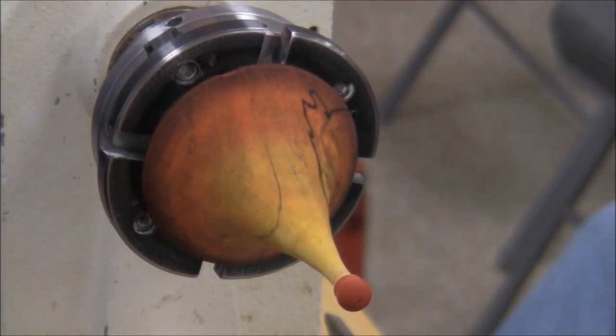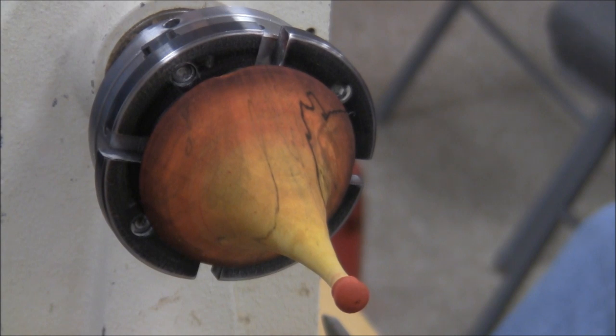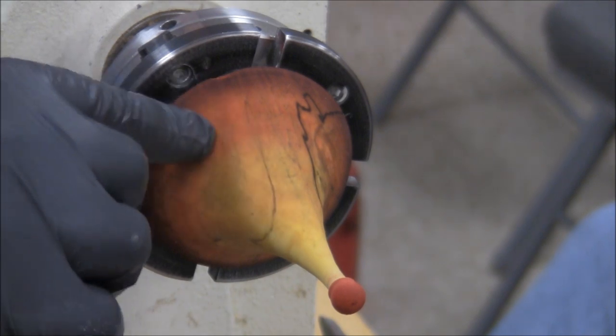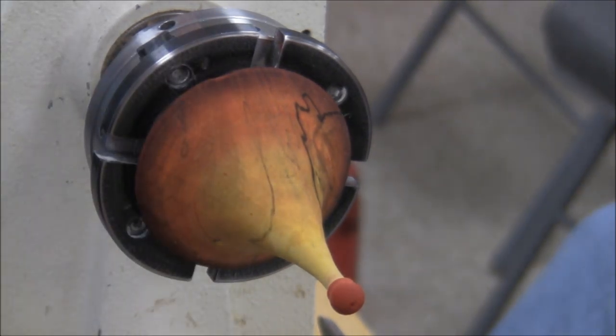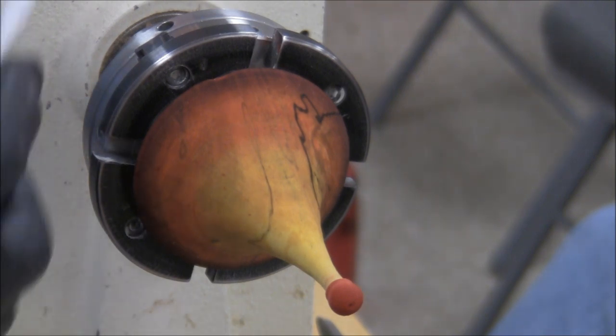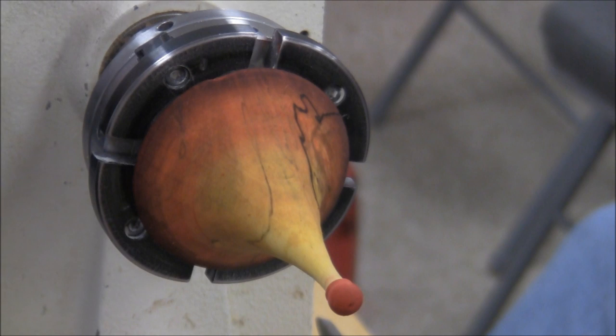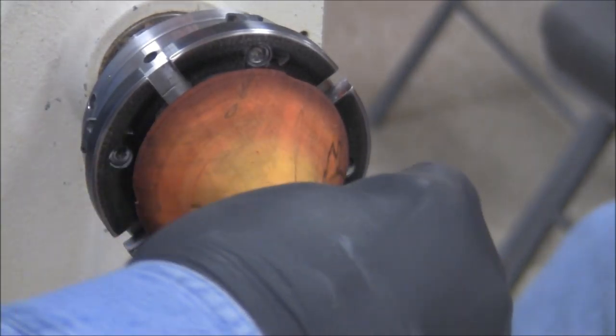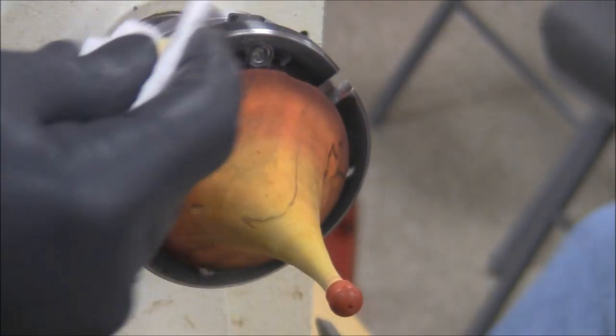Tried blending the colors with the alcohol tint, the alcohol dye? No, I haven't used alcohol mix. I have used the tint in a 1 pound cut of shellac and sprayed it with an airbrush. This works okay on real small stuff, something the size of a pen, like that. These birdhouses work. I wouldn't try it on an 8-inch bowl. It wouldn't come out smooth enough to suit me. If you used a whole lot of water to dilute it, you might get away with it. But generally, I wouldn't. Then I would resort to spraying it pre-mixed in some shellac, and that way you can control the build, and you get a level of blend and control that you just can't touch doing it by hand.